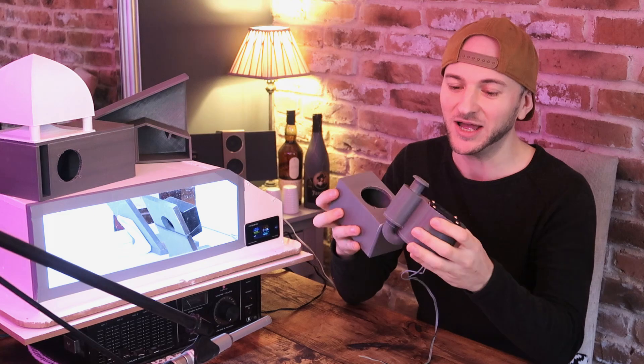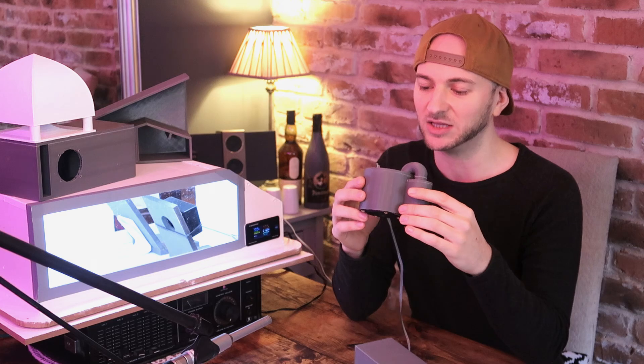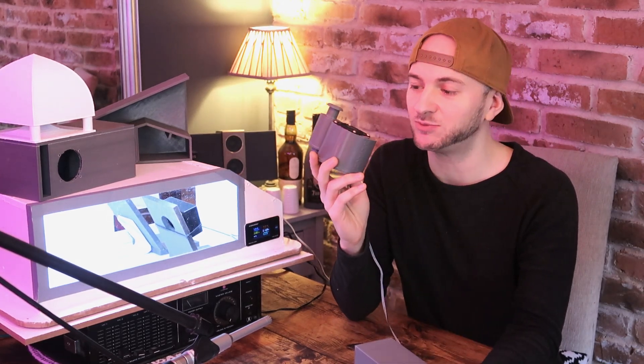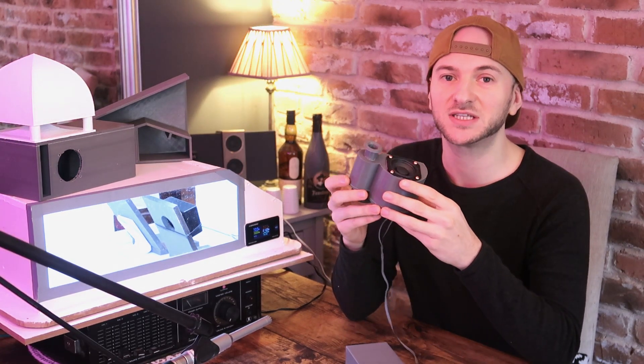The size of it is nice and small. It printed very quickly — can't be said for some of the other submissions we've had so far. It's actually less internal volume than my original benchmark aeroported box. The port is about the same size, but if you include this secondary chamber, it's a bit longer and curves around into the back of the box. Really cool looking little box. I suspect we're going to be able to throw the full 15 watts into it and it's barely going to get started, so this might work better when we can crank up the power in a future season with a woofer that can take 30 to 50 watts.